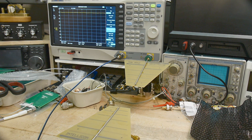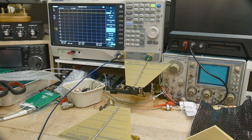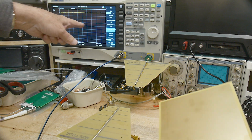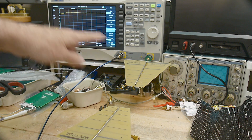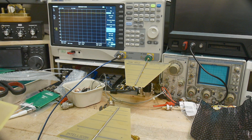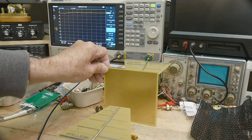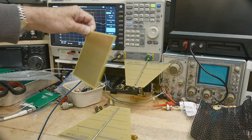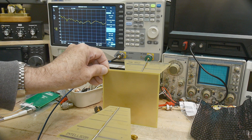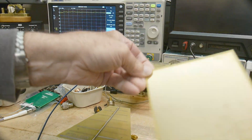A while back I did a video on polarization of antennas and I showed off a wire grid polarizer that I built. I had my spectrum analyzer, transmitting with one antenna and receiving with another. I normalized it, and when I put in vertical wires nothing happens, but with horizontal wires I get about a 15 dB drop because of polarization.